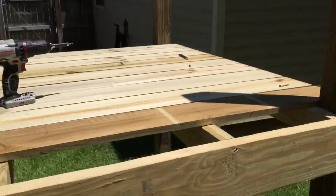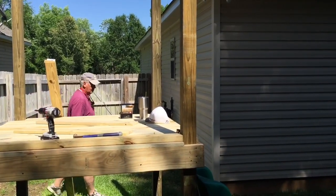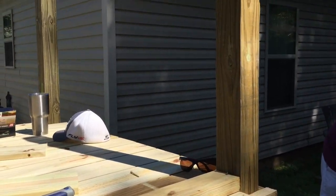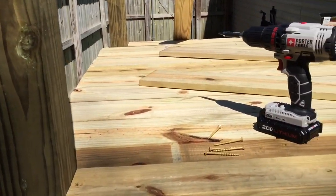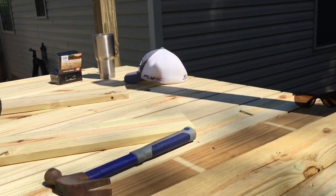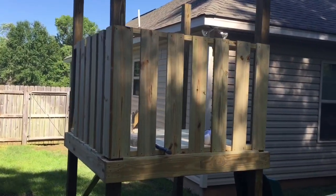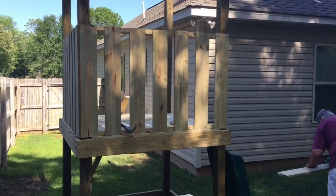We're about to do the railings and the balusters next. We finished the decking and now we're working on the rails. We put the bottom rail for our balusters to connect to, then going up 36 inches and putting our top one. We'll do that all the way around the back side and that side over there. The front side will only be 30 inches because we have the slide and the steps. We got just the two sections of where the slide and where the ladder is going to go.